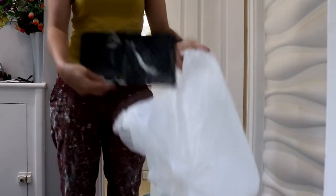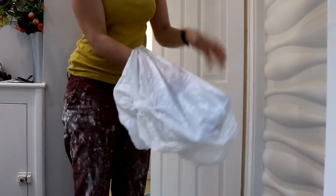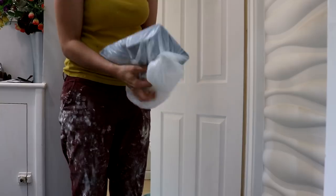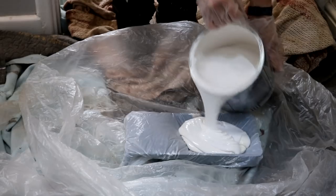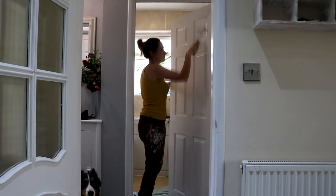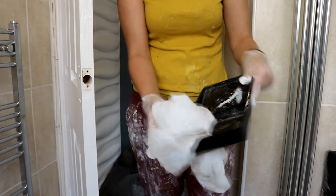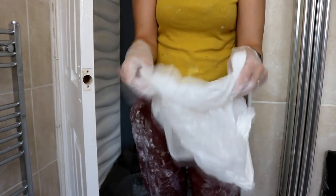Then I had to paint the bedroom door. I didn't catch that on video, so I'm showing the method I used on our bathroom door instead. This is a subscriber's tip: place a bin liner around a paint tray and sellotape it so it doesn't move. Pour the satinwood straight in, use a paintbrush for any grooves, and apply the rest with a mini paint roller. When you're done, take off the bag, turn it inside out, and throw it away. I'm also wearing gloves for easy cleanup.